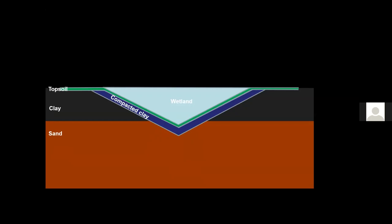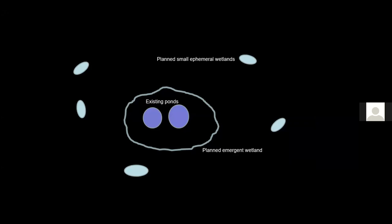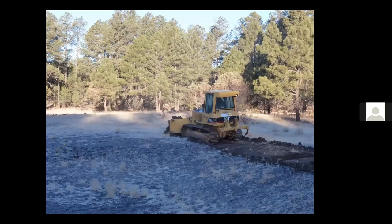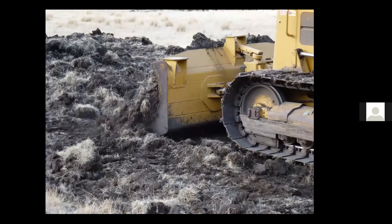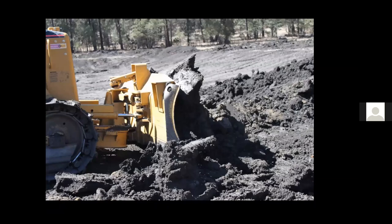We would reshape the deep constructed ponds within Blue Lake and place a thick layer of compacted clay — 70 centimeters thick — in the basin to prevent the ponds from leaking. We wanted the wetland perched on a thick layer of clay that is 70 centimeters thick or more, and it must be compacted or it won't work. We combined the deep constructed ponds into an emergent wetland and planned smaller ephemeral wetlands within the Blue Lake basin. A dozer removed the topsoil, which we saved. The clay was quite compacted so we had to use rippers on the dozer to loosen it, then removed the clay in thick layers and piled it for later use — when you see the orange-colored sand, you've gone deep enough.